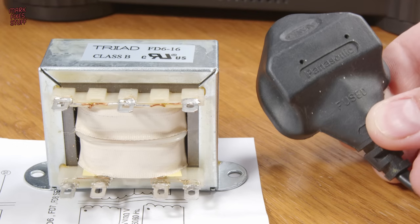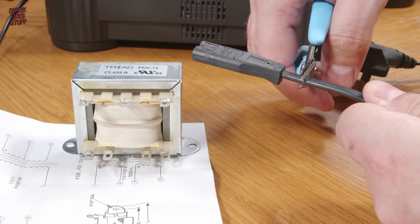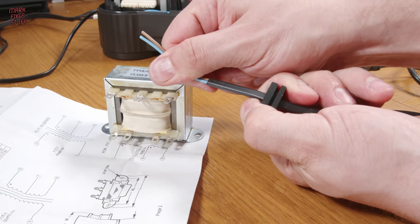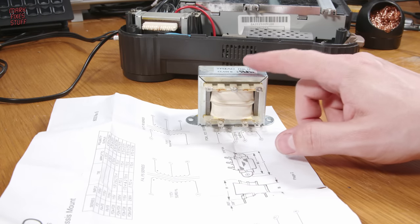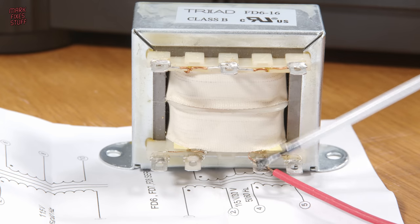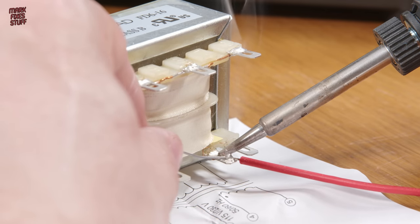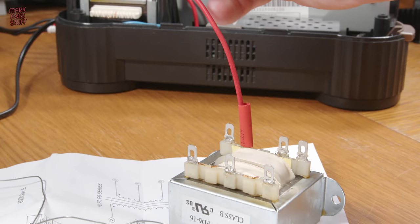I'm going to use this IEC C7 figure-of-8 cable, because it's actually a Panasonic part. Pushing the cable into our 3D printed grommet shows it's a really tight fit. Let's get points 2 and 4 electrically tied together to link the two coils. I'll use a portion of mains cable because I know that will be safe for mains voltage, and of course some lovely flux. I'm soldering straight onto the terminals, but if I had spade connectors and a crimping tool I'd use those — but they were lost in the fire. I'll make sure to use heat shrink insulation to make the install as safe as possible.